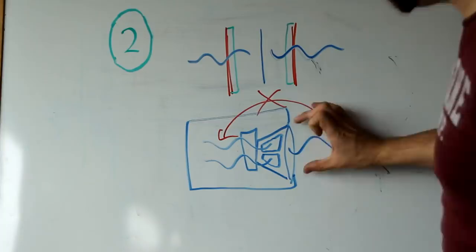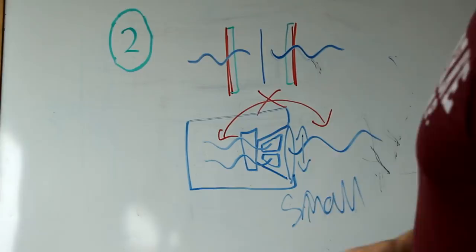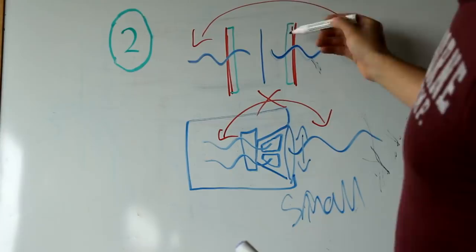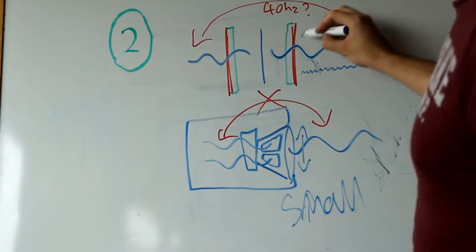The larger the driver, the lower the frequencies that can escape forward from the diaphragm or cone will be. By comparison, conventional loudspeaker drivers are pretty small when looking at electrostatic speaker panels. This is since their cones need to be stiff, and the larger they get, the harder it is for them to stop warping under load or building undesired cross resonances. Since an electrostatic speaker diaphragm is uniformly driven across its surface, it can essentially be as large as you like. As a result, although cancellation still occurs from the front and rear waves meeting, just like a normal woofer without an enclosure, this happens at a considerably lower frequency than with conventional loudspeakers, giving them a very usable frequency response.